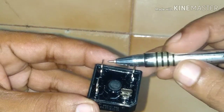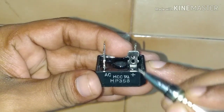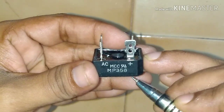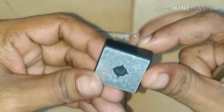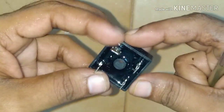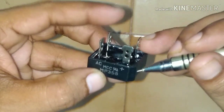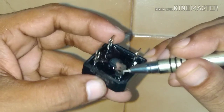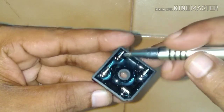There are two diodes in this plate. One will be positive, one will be negative. If you can see, there is numbering: this is your positive terminal and this terminal is your AC. If the numbering on the plate has gone off or is not visible, we can identify terminals using a notch on the plate. The terminal which is closest to the notch is positive, and the terminal which is exactly diagonally opposite to the positive is your negative terminal.